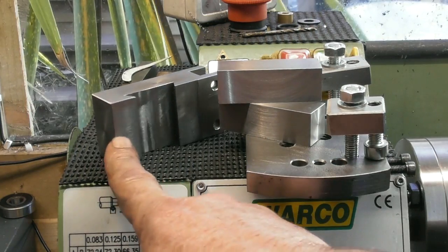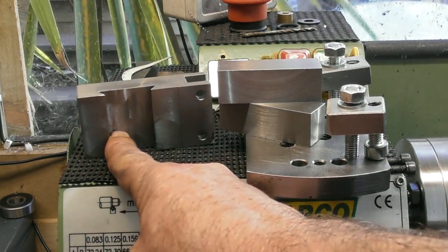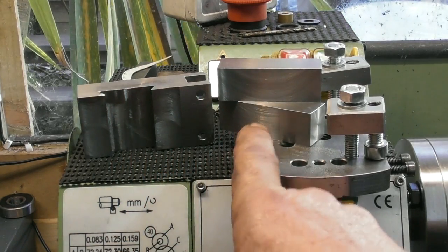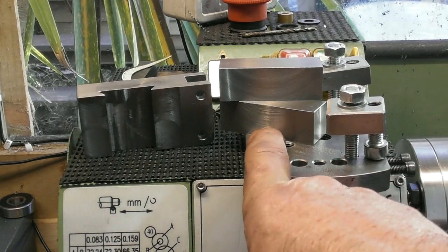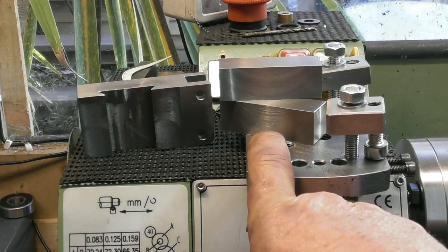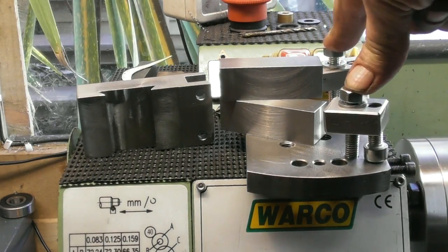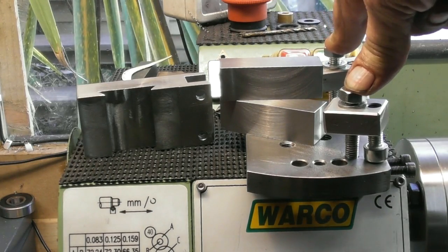So yeah, where are we now? We've got the main holder. Obviously it needs tidying up with radiuses and what have you, with the 2 M6 dowel holes through. And we've got the 20x20x60 EN8 fingers, or arms, all blocked up. And we now have a more effective way of holding stuff more rigidly, shall we say, when I'm milling on the lathe.